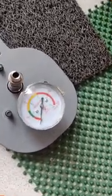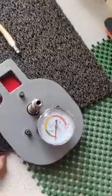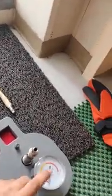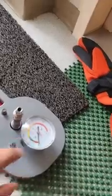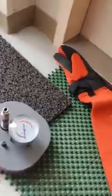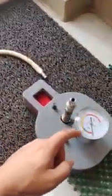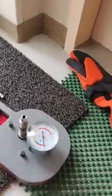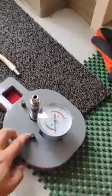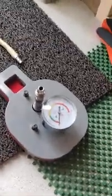The pressure to be filled inside is 0.7 to 1.4 kilopascals — that is the limit. When connecting the ship's air pressure, crack it open only, otherwise it can damage the gauge. The ship's air is in bars and the gauge is in kilopascals, so there is a big difference. We will open slowly and hold at the maximum pressure of 1.4 kilopascals.